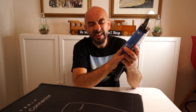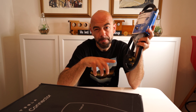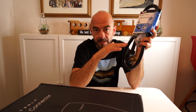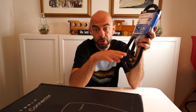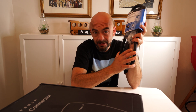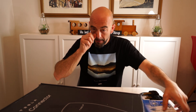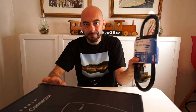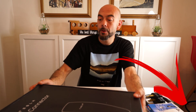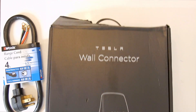This is a 50 amp cable, so the charger itself you cannot put it any higher than 50 amps. I believe I actually have a 60 amp breaker in the house, but this cable is 50 amps, so we're going to make sure that when we set up the charger we don't overpower the wire that we're using to plug it in, as well as we don't overpower the outlet either. Link in the description to Amazon below if you want to pick up one of those, and then let's get into the Tesla wall connector.